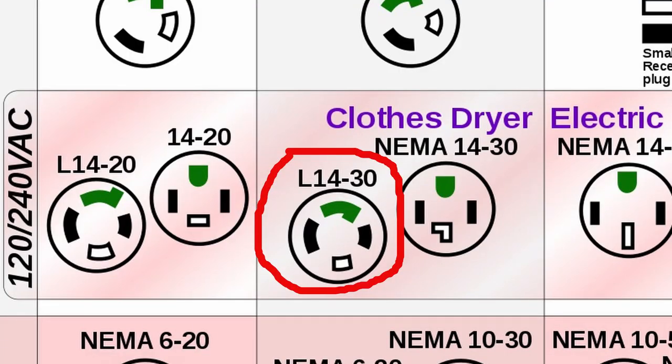There's also a round version of the NEMA 14-30, which I think is the L14-30. That's the same arrangement but in a round format — that's not what I got here. The only brew system I currently have that's electric 240 volt is the Spike Brewing E-brew in-the-bag system, which by default required that same NEMA 14-30 standard. If you have a different type of homebrew plug, you'll have to make adjustments for that, but I'm just showing you what I did.